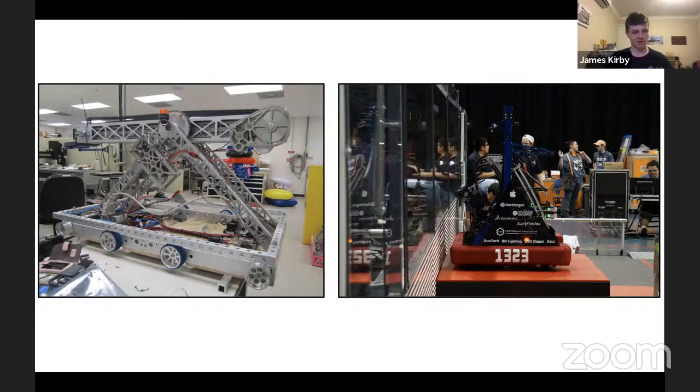And on the left here, we have a great example from Team Spectrum's website, their 2011 collection of photographs. This is a picture of, I'm pretty sure, the pink team's arm and whatnot from 2011. It uses various gears, it uses various chains and sprockets, obviously beautifully constructed, but even the linear motion of that arm is powered by a motor turning some gears to get the correct motion out to pull a winch. And the entire arm is rotated by a sprocket because it allows for pretty much infinite positioning within the total degrees of motion.